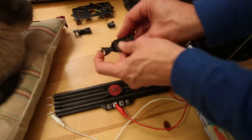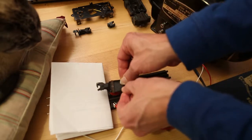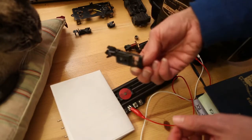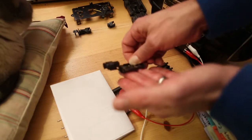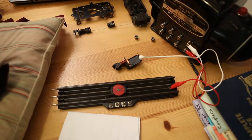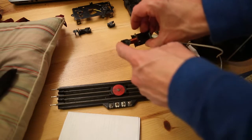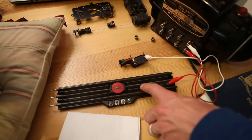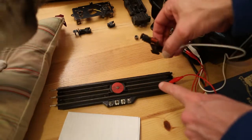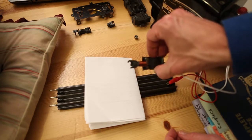The electromagnet is now powered. The coupler opened. In fact, since I was not controlling the ZW transformer, the electromagnet stuck to the coupler and I was actually able to lift it up off the table. Now we're going to test the coupler that uses the shoe to give power to the onboard solenoid. I currently have power being delivered to one of the interior rails of the RCS, and we're going to put the shoe on that rail — and the coupler opened.